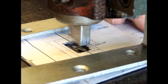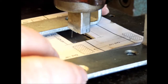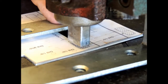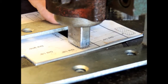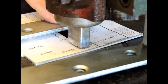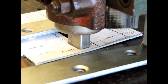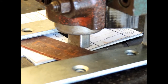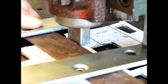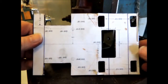Come along and open that hole up. There — that's the centerpiece for the LEDs. Now these other ones for the sensors are going to be a little tricky, so take your time lining them up. These ones are going to need the aluminum supported — take your metal ruler, slide it under there, and slowly lift it up until it releases. There's our finished piece of aluminum punched out.